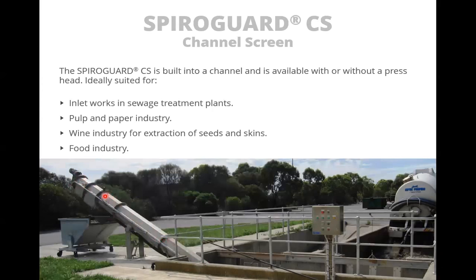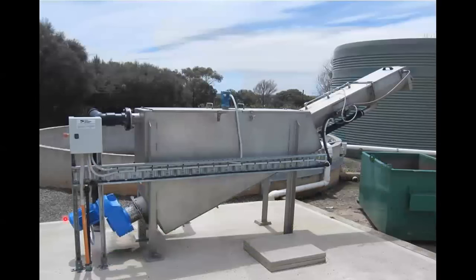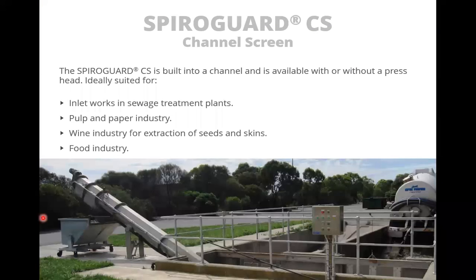Again, one moving part. The advantage of the previous unit, I'll just go back one step, because it's a pushing gearbox, you can put a press head on the end of it and you can get very good compaction on the discharge of that unit. Whereas on these, because it's a pulling drive, your screenings will not be quite as dry as they will be coming out of a compactor unit like that. We see these in a lot of different applications, not just wastewater plants, but the pulp and paper industry, wine industry, food industry, abattoirs, that sort of plants like these systems. They're quite inexpensive, quite reliable, and they're easy to service.